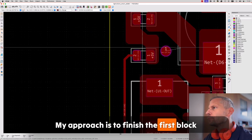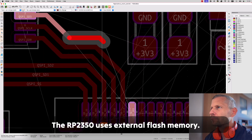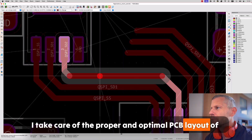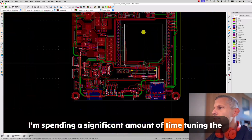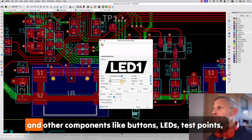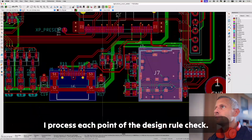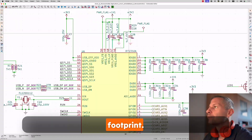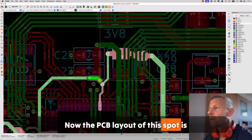The 3D model of the PCB needs the correct 3D model of the note card. The PCB layout job can start. I am focusing on the power supplies because the note card power consumption can be as high as 3A peak — this is the reason I use copper zones instead of tracks for loaded spots. The power outputs and analog inputs use almost a symmetrical PCB layout. My approach is to finish the first block and then copy the layout to the other ones. The RP2350 uses external flash memory. I take care of the proper and optimal PCB layout of each track. The board's power distribution is crucial and I am spending a significant amount of time tuning the power tracks. The silkscreen layer contains essential labels for the connectors and other components like buttons, LEDs, test points, etc. I process each point of the design rule check. Because of one warning, I am modifying the terminal footprint. I returned to the low voltage switcher filter of the MCU — now the PCB layout of this part is much better.